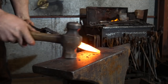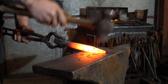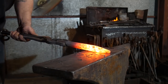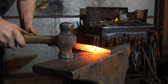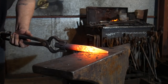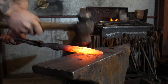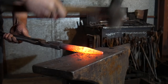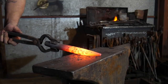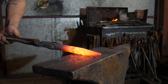We'll have a four-sided taper that tapers to the center of the bar, and then I'm just going to tap it up onto the corners and set those in to start with. Working down the length stops the material from twisting, as opposed to going straight for the rotation — if you do that, the material twists quite a lot.